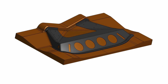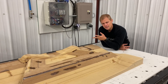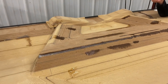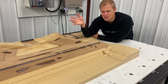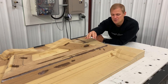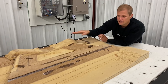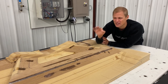In production, we would machine a plug first and then make a mold off that plug, so it's a slower and more costly process for a full production tool. You can see there are areas here where we've applied epoxy. We cut all these pieces out as rough rectangles and trapezoids with a circular saw, so they're not super precise pieces of stock that we glued together. We knew there would be some gaps, and you can see where we've filled those gaps with epoxy after the rough cut where those little gaps opened up.